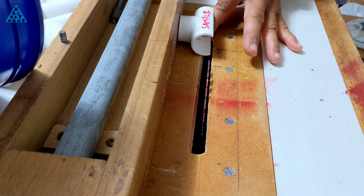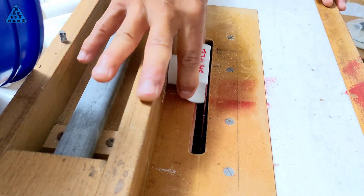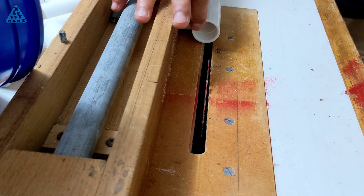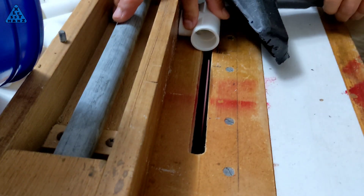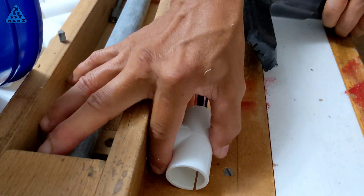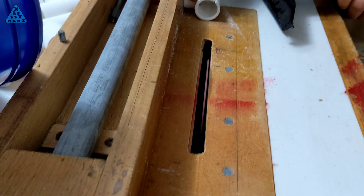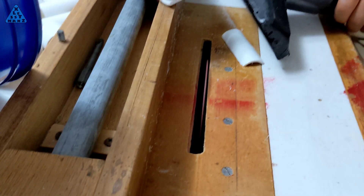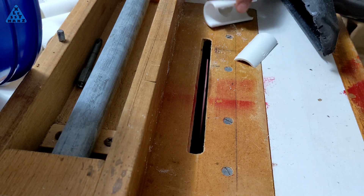The second modified joint shown on the sketch is the snap-on. This joint makes it possible to add and remove sections of PVC without having to disassemble anything already built. When creating snap-on joints, it's a good idea to ream them first, then cut the slot. The reaming helps the inner surface of the snap-on sit more flush against the PVC pipe when attached, preventing the joint from rocking.